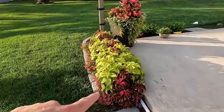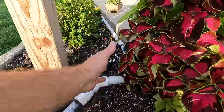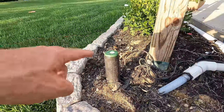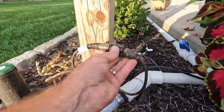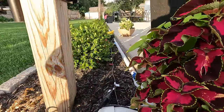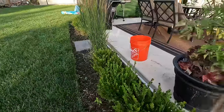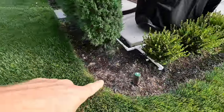So it's an above-ground system. We ran the line along the patio here, and you saw me installing this part. We did one-inch piping. I put one valve here just so I can test this one to see how far the head actually will throw — the head's throwing 33 feet, which is awesome. And with our connectors, this goes back to the controller and this one here is our next lead wire that's going to daisy chain out. We ran the line all the way down along the patio and we'll cover that back up with mulch.